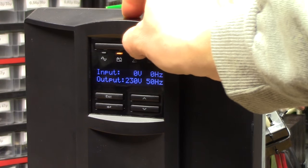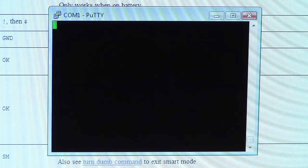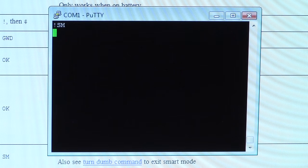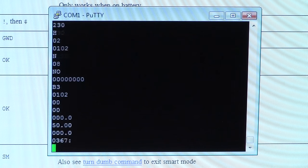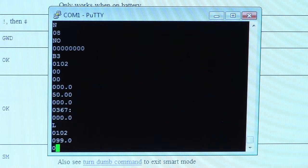Let's check the serial console to see what it's saying. If we send it the Y character — yep, we get back 'SM' for smart. That means we should be able to turn it off as well by sending it two Z characters in series. And yes indeed. And if we flick the switch back, we get the constant stream of data that the communications processor inside the unit is requesting from the main processor. So that's just working fine and dandy.